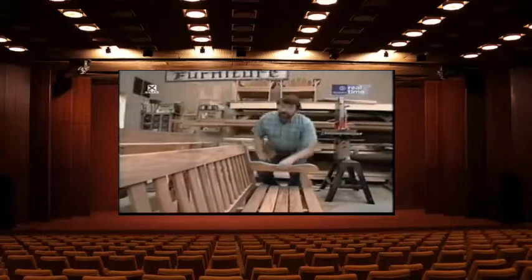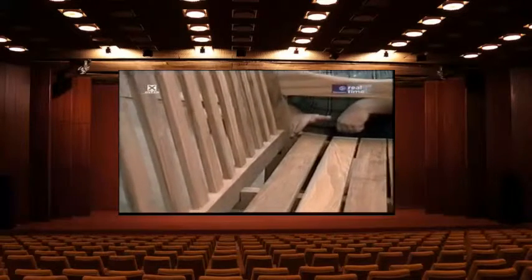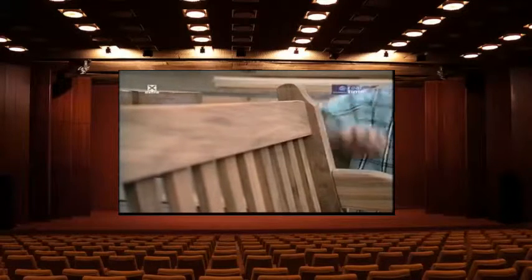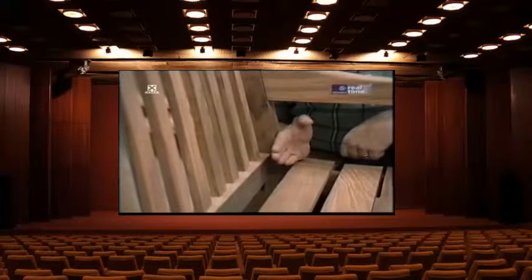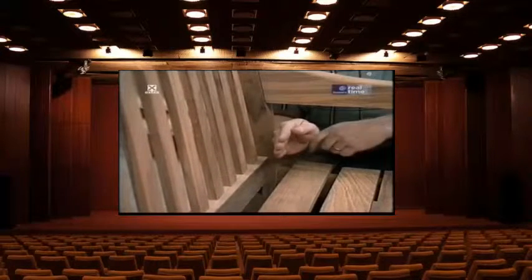Now for a difficult part of the project, but a nice refinement for our garden bench. This bottom rail runs parallel to the lower portion of the leg here, as well as the top rail runs parallel to the backrest slant. Now I suppose I could twist this bottom rail so that the mortises for the slats would be straight in. But this little turn back down gives a lot of refinement to the project,